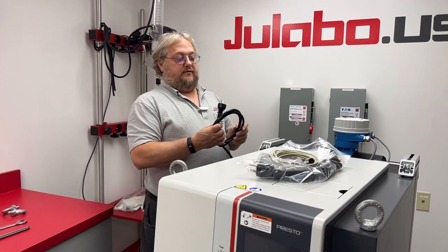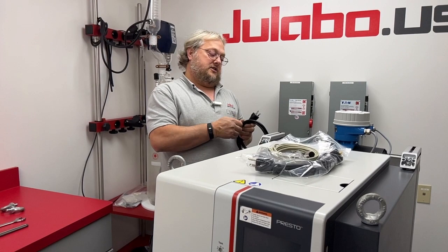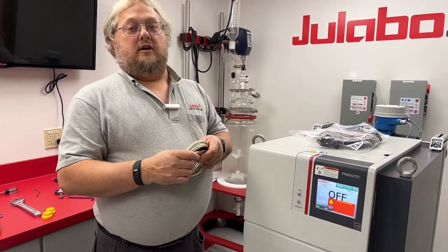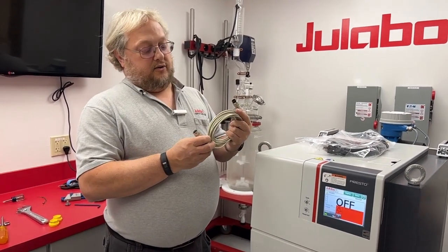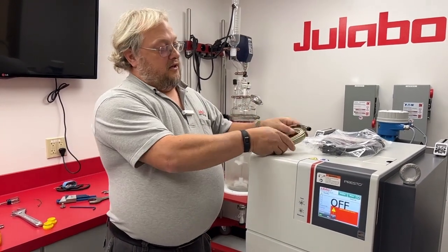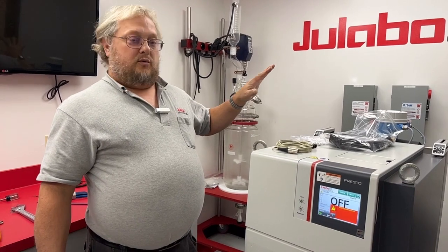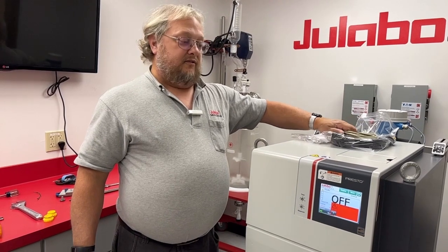One thing to remember with all of the flow control solutions: you're going to require a single phase outlet as well as the power for the Presto — this is to power the flow meter. In addition to the cables shown, which would be valid for any Presto flow control solution, this one has an additional cable for controlling the HSP pump. It connects between the alarm output and the HSP pump itself, which has a separate outlet. So this one requires two single phase outlets plus the three phase power that the W50 requires.